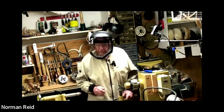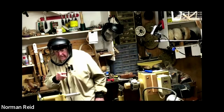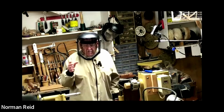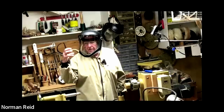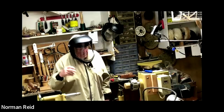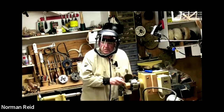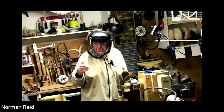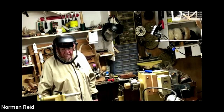Yeah, it's a spindle. Yes, with end grain boxes, I have found that if you have a pith in the box, it makes it a whole lot harder to keep it round. The tangential shrinkage around the pith will create distortions, and so you want to have basically side grain just to make your box work. You can do it. You're going to have a twice turned box because it's going to distort on you, and you're going to need to turn it again after it's distorted.